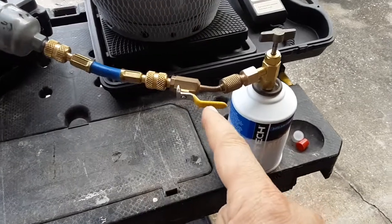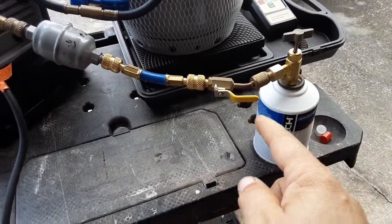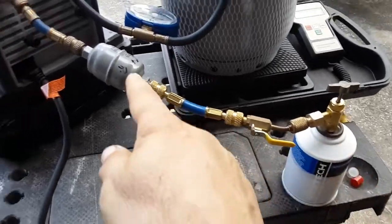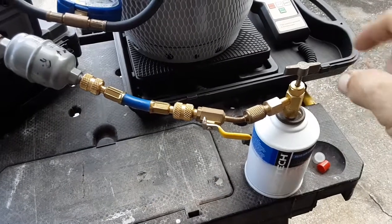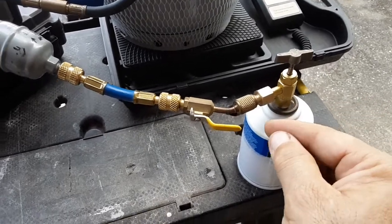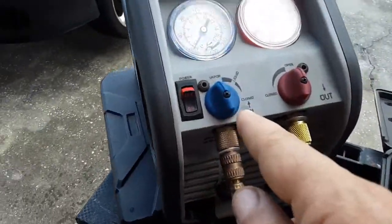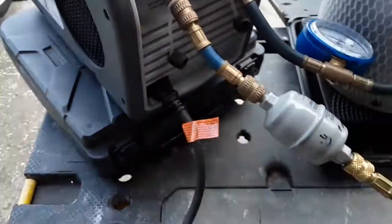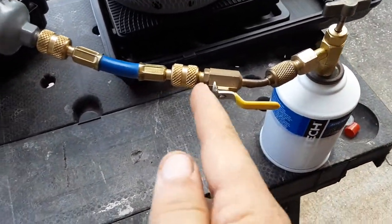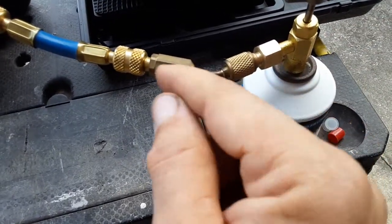What I did was I got this valve here that fits these quarter-inch fittings. And this minimizes having to purge the line, because when this is off and you first open this, there's a little bit of air trapped right here from switching out cans. So basically I purge it right here because this will be in the off position when it's done. I can purge it right there — this valve will be off, so anything in here is still good.